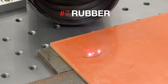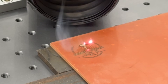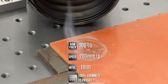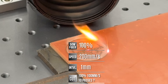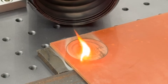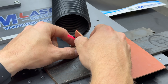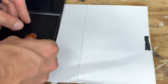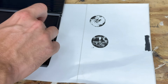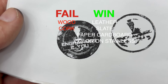Next up, I tried making some custom rubber stamps, and this one was a pleasant surprise. Using laser-safe rubber, the fiber laser was able to engrave deep and detailed impressions that held sharp lines even in small text and logos. I used moderate speed with full power and a tight line interval, and it carved out a clean, usable stamp surface in just a few passes. Cleanup was a bit messy — rubber creates a lot of powder and smells a bit like a tire fire while engraving — but thankfully I was running the Xtool AP2 air purifier, and it did a great job keeping the smells down. Once your engravings are done, the results are solid. I can definitely see the potential here for branding, crafts, or custom packaging. With a little finishing work, rubber is another win for fiber lasers.